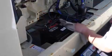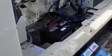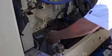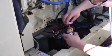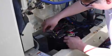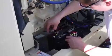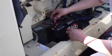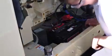Clean battery surfaces. Dirt can block current flow in connectors and cause resistance between terminals. Dirty or corroded terminals and connectors should be cleaned with a wire brush dipped in a solution of 1 pound of baking soda mixed with 1 gallon of water. After cleaning, rinse with clean water and coat terminals with a thin coat of petroleum jelly or a corrosion inhibitor. Inspect, clean, and protect battery terminals.